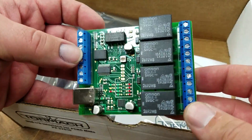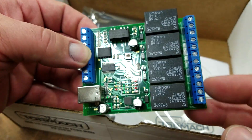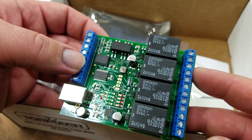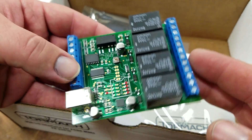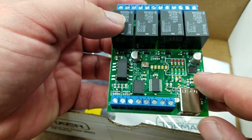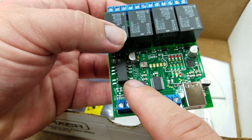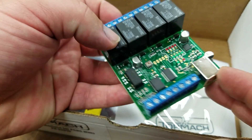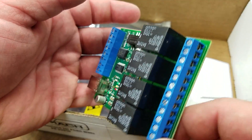This is the Tormach I/O board. They came out with this a couple of years back, and we're going to use this bit of kit to power our automation project on the 770. It comes with four inputs and four outputs. We're not going to use the inputs in our application, but we are going to use these top two outputs that are relay-driven to run our 24-volt DC solenoids — to open our air collet closer and to run our linear actuator for the parts catcher. One undocumented feature they don't tell you about in the instructions is this little dial right here. You can put up to four of these boards on a Tormach to get up to 16 different inputs and outputs. The first position gets you P0 through P3, the second position gets you P4 through P7, and so on. All you've got to do is set each board to a consecutive position on that dial. They're all USB-driven and they do work through a USB hub. Let's go ahead and get this board installed on our 770, wired up, and see it actually move the air collet closer and parts catcher.